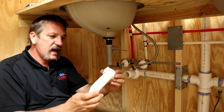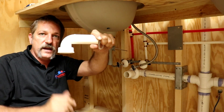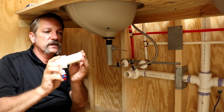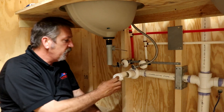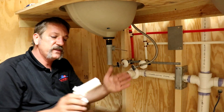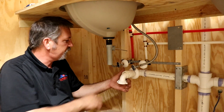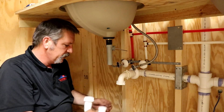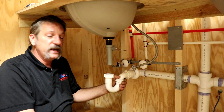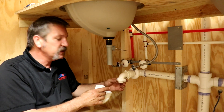Take your pieces — you've got the one that goes down with the threaded piece, then one for the wall, and then your little compression washer — the little beveled grommet goes on like so, and then you put it in the wall. I've cut these already to save time. This one is a little bit longer so you might have to trim it up. Then once you've got that going you can kind of hold your p-trap up there, because you're going to need that tailpiece extension. You could rough this in perfectly so you don't need the extension, but that's kind of hard to do.